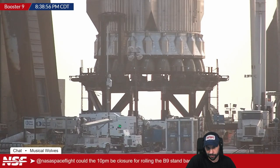From what I understand, it looks like Fondag to me, from the pumper trucks that came in and checked everything. Keep in mind, I didn't get a good look at them, and you don't know what type of concrete is in the concrete truck. You don't know for sure. There's more than one type of concrete. Fondag is designed for high temperatures. It's very thermally resistant structural concrete. Good for a flame trench.